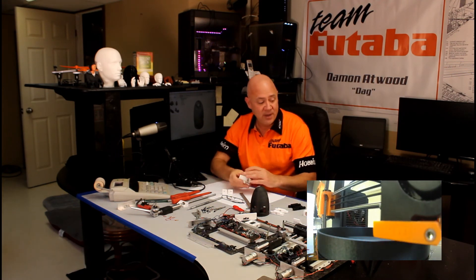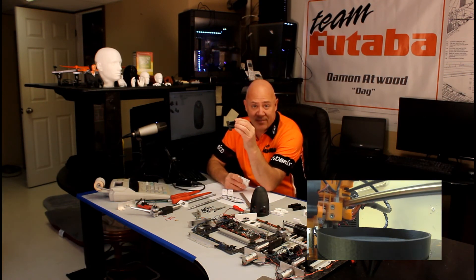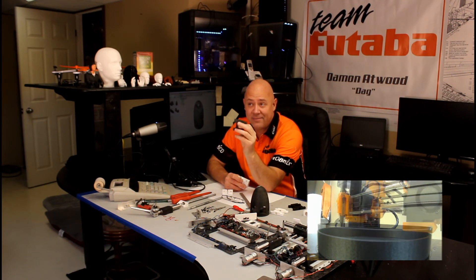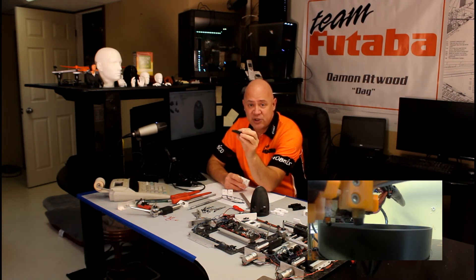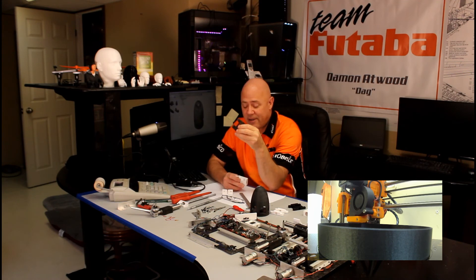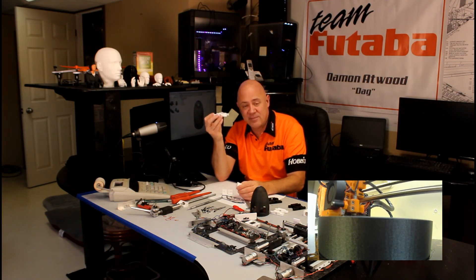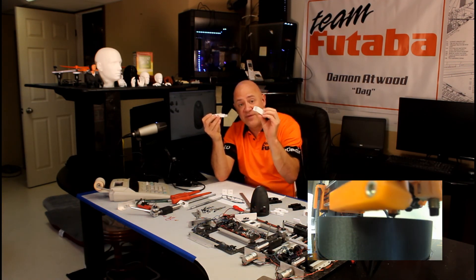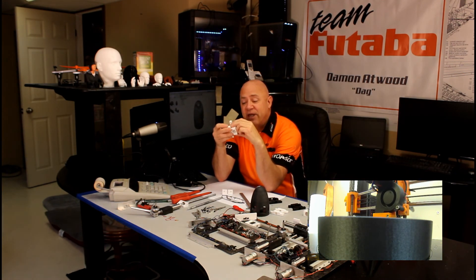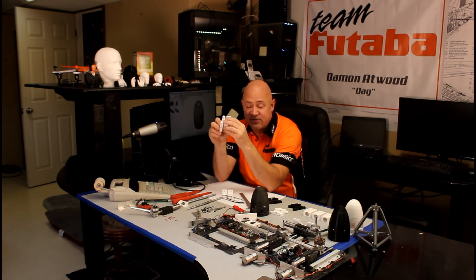My testing on ABS — I machined this part by hand out of Delrin and it's really strong, but getting all of the specs perfect was really, really hard to machine. When I 3D print the part, the specs are going to be almost exact, down to a tenth of a millimeter. This is what the strut of the landing gear goes on — it screws together and this slides up and down the tracks to retract my landing gear. I've had an awful lot of success with printing ABS and PETG, but with nylon at thicker dimensions, I still have a problem.